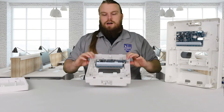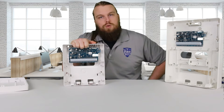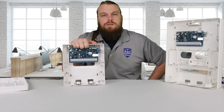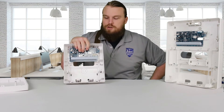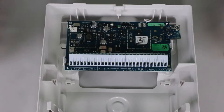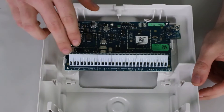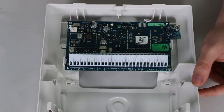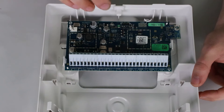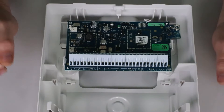To give you an overview: you can have a total of four DSC Neo keypads connected, four DSC Neo zone expanders, the HSM 2108, and one HSM 2300 power supply module. Now, zoomed in on the small cabinet — the PG9-WLSH-W8 — the terminals on the boards are the exact same between both models, so everything here is exactly how you will see it on the PG9-HRD-W8 as well.